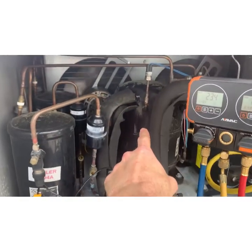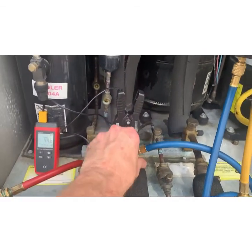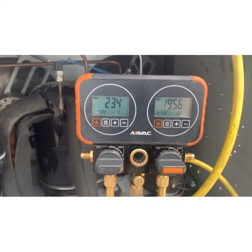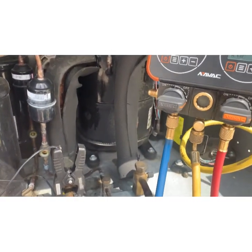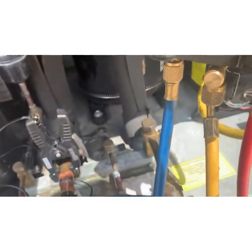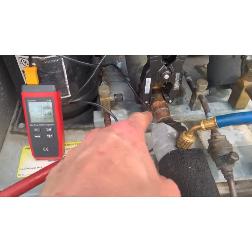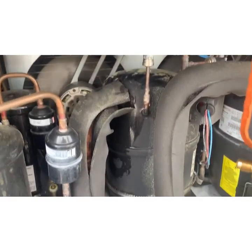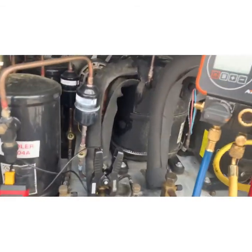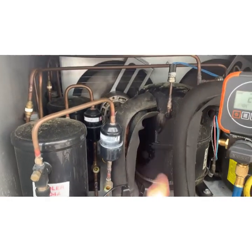The cooler's running right now. The freezer's not. It's still satisfied. I'm going to do a test. One, I took my stubbies off and I put my real gauges on just to make sure it wasn't a port issue. Obviously it's not, but we're not running it. So these are just stale temperatures. They're stale. You can see that the ice is melted quickly around the compressor, working its way back to suction line. So, like I said, it just needs to satisfy more frequently, and that wouldn't happen.